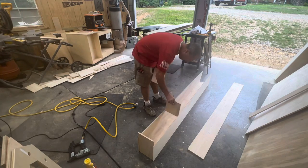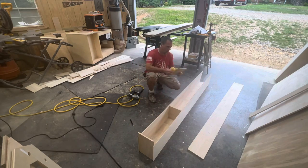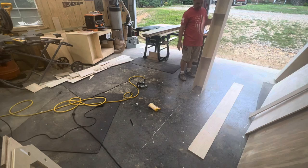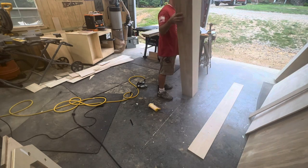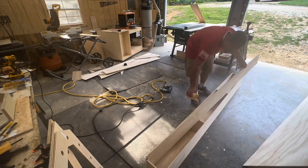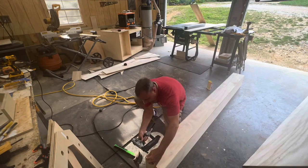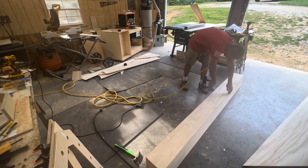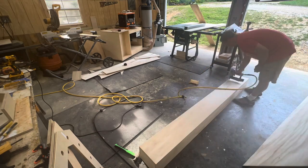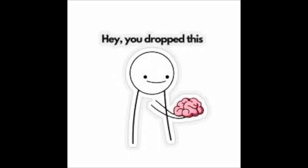The way I came up with to make these stronger and stable, since I'm using quarter-inch plywood on the sides, is just to cut some square half-inch plywood and put them in there, and once you put the top on and glue it, you're good. This is like James King level glue-up — if you don't know what I'm talking about, go look up King's Fine Woodworking. He uses more glue than anyone I've ever seen, but you need glue on all the edges so they stay square and strong, and if your client drops them, they don't bust open.